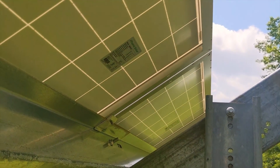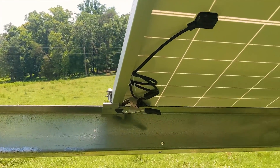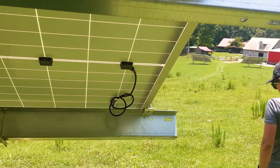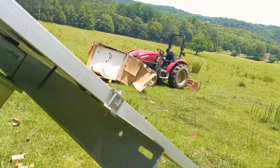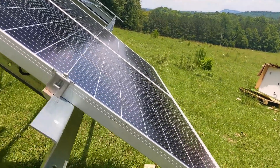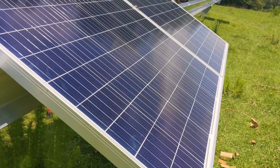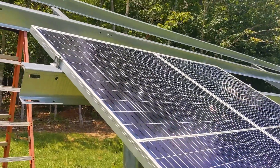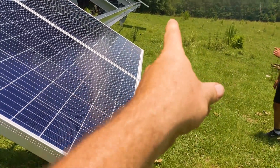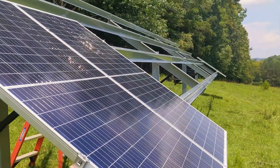However you're wiring it — in my case they're both going to go up for paralleling, which works best. No leapfrogging on this one. We're going to have two strings of nine and two strings of eight for 34 panels at 400 watts times 34 — so whatever that is, this is going to be awesome. Just a little trick: do this by eye, lining that up saves you a lot of time trying to measure off purlins because the purlins do have a little wave to them due to play in the bolts.